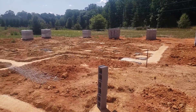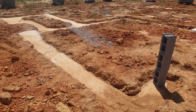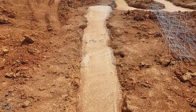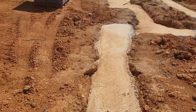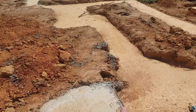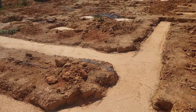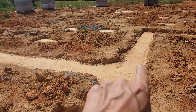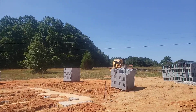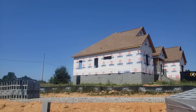We're about to start a foundation here. This concrete is called the footing. This is basically a trench in the ground dug down to what we call load-bearing capacity soil — or the more technical term, hard dirt that can hold up the house. This concrete looks like a trough and we have steps where the elevation changes. That holds up the house. We build a cinder block wall — that's what all these cinder blocks, these masonry blocks, are over here. There's one in process now that will look a lot better when it's done.